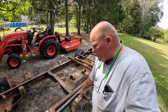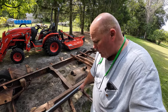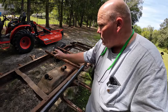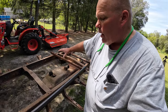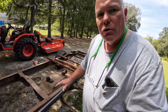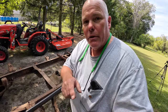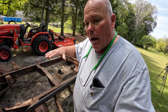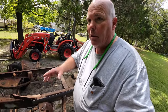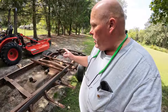So here's the plan: I have this two-inch angle iron here, it's 3/16 inch thick — probably could have gotten away with 1/8 inch and that would have done just fine. I'm just going to lay it over where the body mounts are, then repeat that process on the other side, tie it together, flip it over, and weld it up. I'll build a little box or platform so I can flip it upside down and it'll match up perfectly to the body mounts under the cab. Then I'll have a platform to set the cab down on and use the forks on the tractor to pick it up and pull it in the garage when I want to work on it.